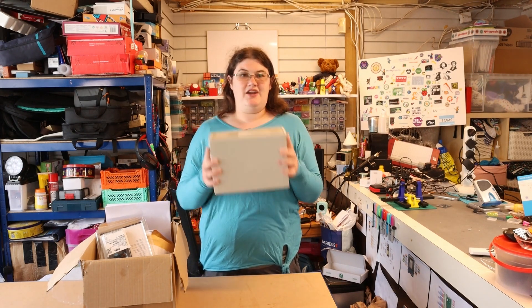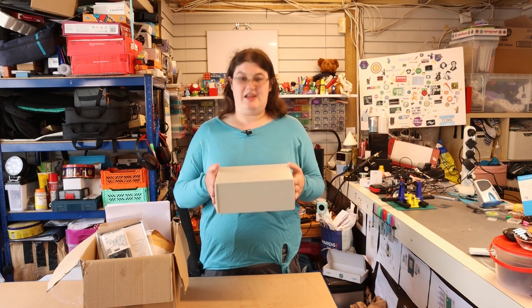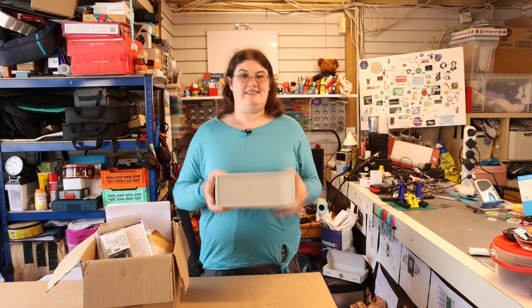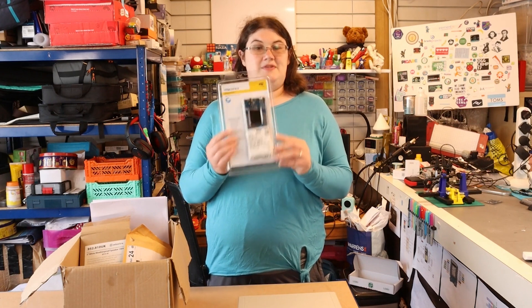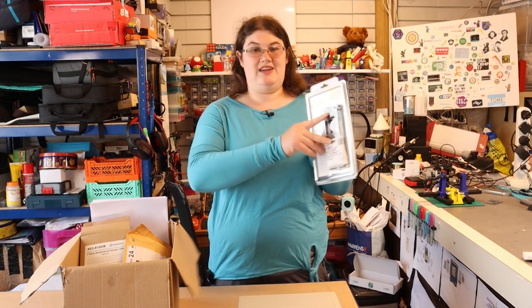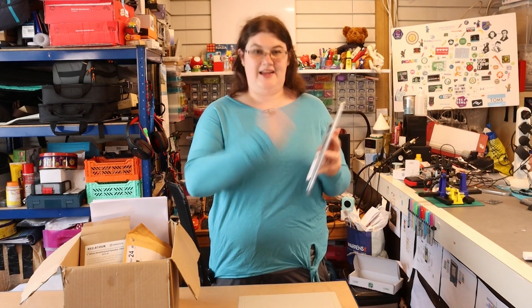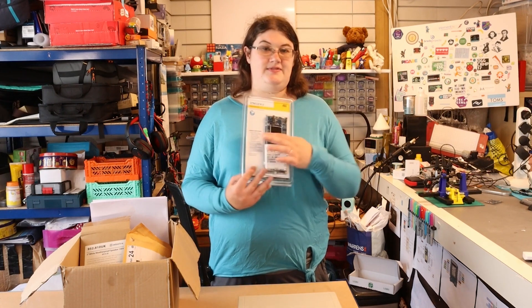My parts have arrived, so I've ordered a fairly big enclosure. I could have made it as small as possible, but it's easy for stuff to get misplaced when in a band there's a lot of big pieces of percussion and other instruments. The brains of it is going to be this STM32F4 Discovery Board. I picked this because it's got audio out, it's got built-in I2S, and it's got a micro SD card reader, so I can plug in my SD card and plug in an amplifier to the speaker directly on it, and I've got quite a lot of GPIO that I can use for push buttons and screens.